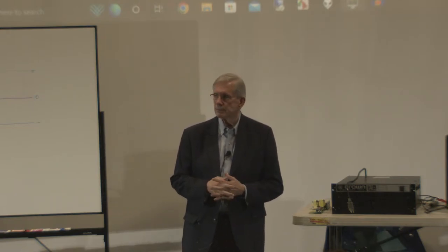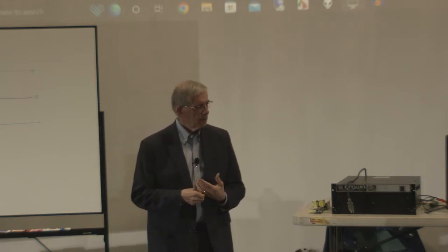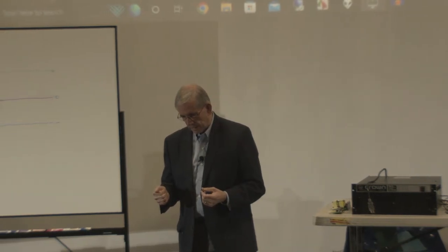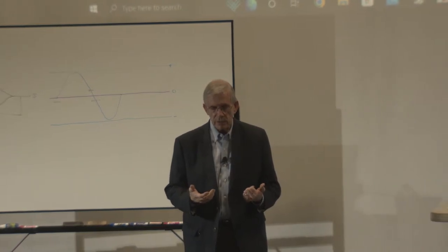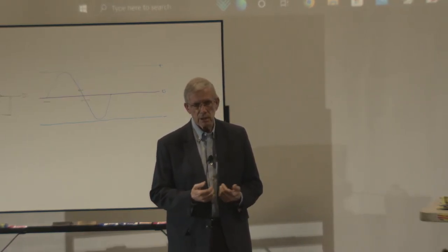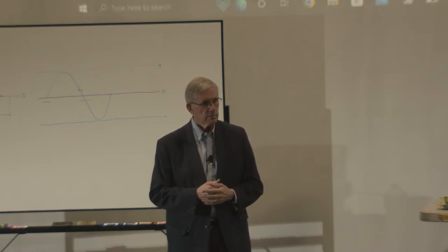Can you multiply the RMS to get the peak power, or is it more complicated? You can go into Wikipedia and look up RMS, see how it's calculated. But typically, the specification is that RMS is 0.707 of the peak. A couple guys figured that out, and that's the rule of thumb that I use. RMS is 0.707 of the peak, and that's in the amplifier, that's not the speaker.